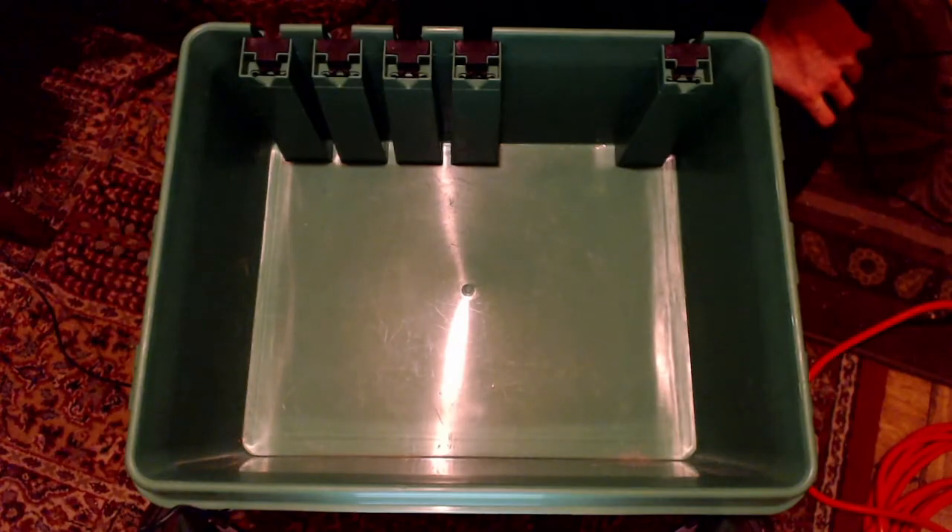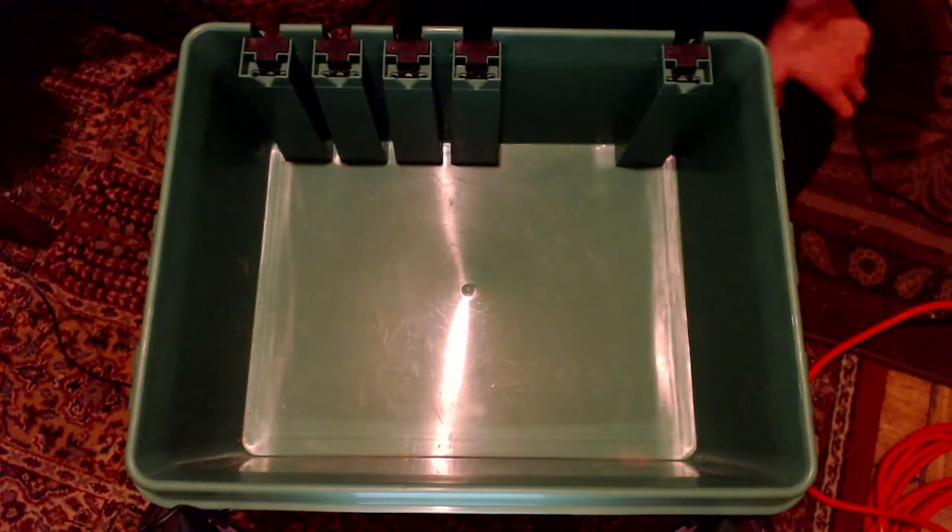Let's start by looking at the waterproof case. First thing in here is the 12 volt power supply — I currently use an old PC power supply as it will provide more than adequate current on the 12 volt rail. If you want to use an old PC power supply, just connect the green wire from the main motherboard connector to 0 volt — the black wires.